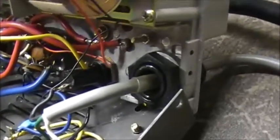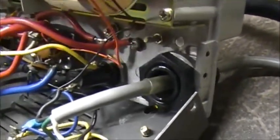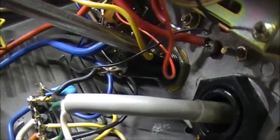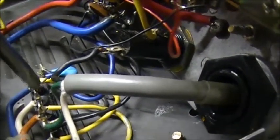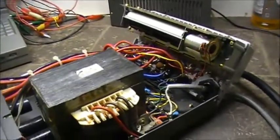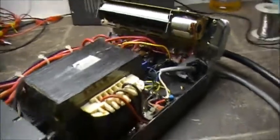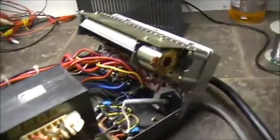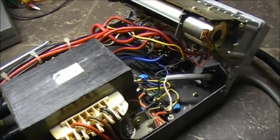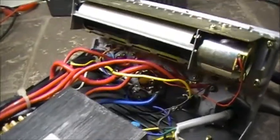All you gotta do is remove this yellow wire, well, you know, if we want to momentarily power this thing up. Basically, you run a wire, put a clip, alligator clip, whatever, from here, up here, to right there. Jumper wire. And you'll turn this sucker on. There's quite a few modifications out there for these power supplies. One of which is to add a switch to the front panel, so you can use this power supply pretty much on anything. It's easy. Nothing to it. But we'll leave that up to the owner, what they want to do with it.